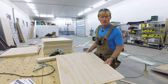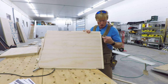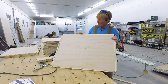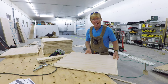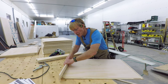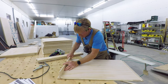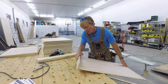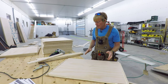The first process was to run these through the table saw, starting with setting up to do the dados on the sides so that I had three-eighths of an inch left over, and then the rabbets on the front and backs that are flush — they're the same width but obviously this one's open, making it a rabbet. I did that on the table saw with the dado blade, so I've got a really nice fit by adjusting the dado with the magnetic shims. These fit in perfectly and they're not super tight — there's just the tiniest bit of a gap, but not enough to make a difference in size or spacing, just to help me for assembly. This will be a great glue channel and help me line everything up.